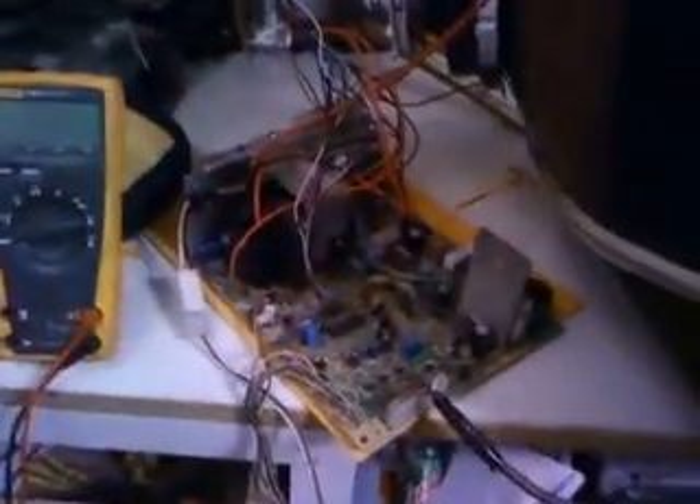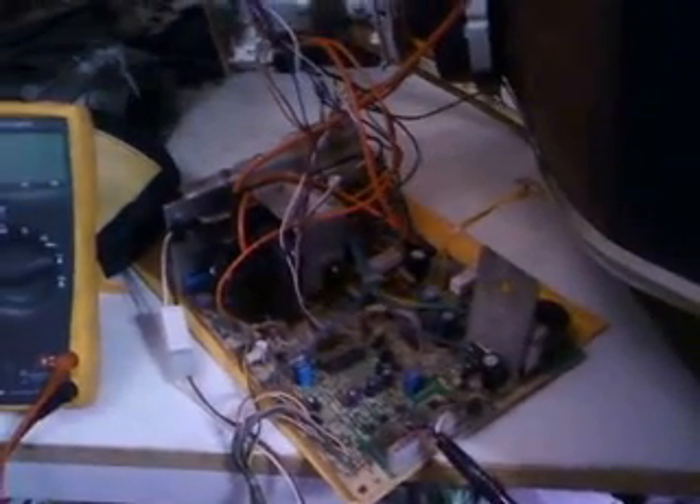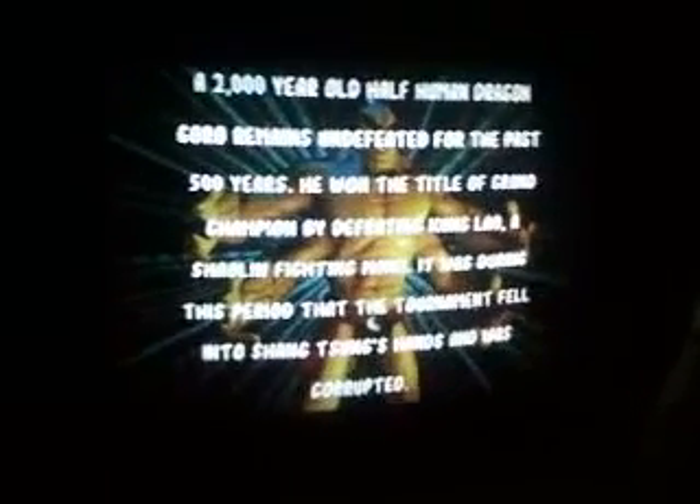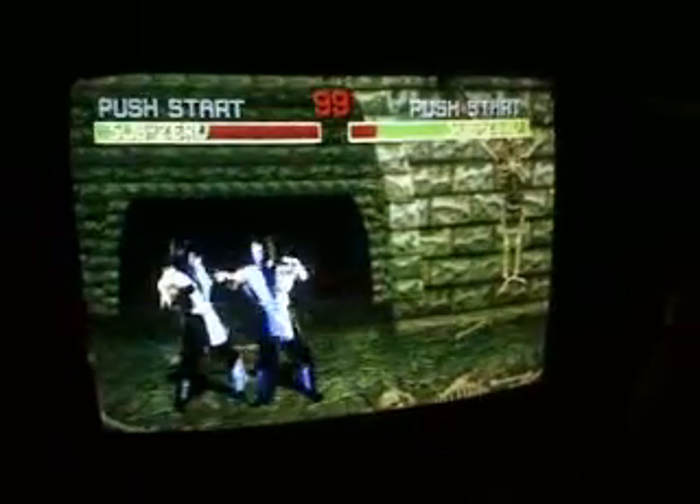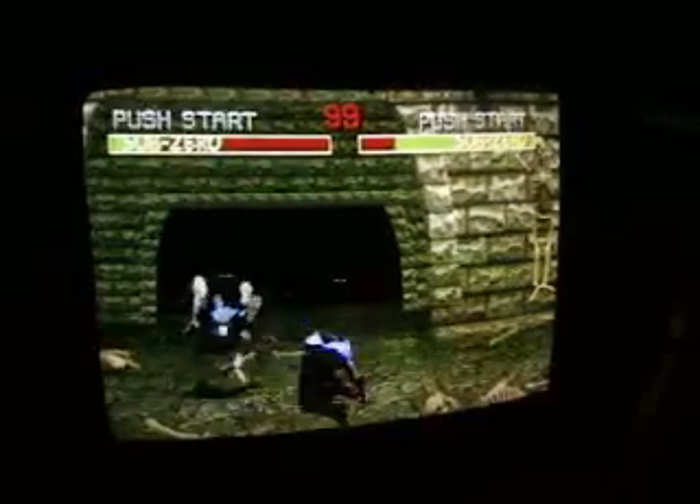As you can see, the monitor's been running for a while. Here's the chassis running just fine. All this has been adjusted to my tube — he will have to readjust it to his tube or whatever tube he puts on when he gets it back. Ignore the snow if you can see it; that is my test station. The chassis has been running for a good while with no issues. Colors are all nice and adjust just fine. Brightness, contrast — all adjustments work as they should.